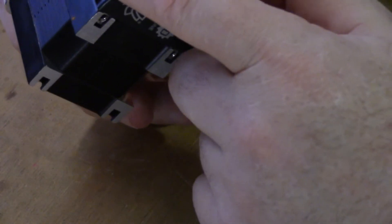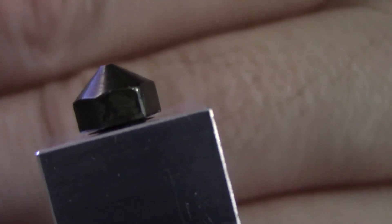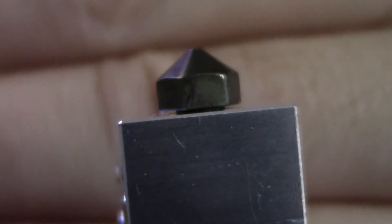There we go. Now it is still off the block a little — very little. It zoomed in. If you look, it's still a hair off the block, and that's what you want. And that's really all there is to it — it's not that hard. But you definitely want to make sure that nozzle is not on the block.